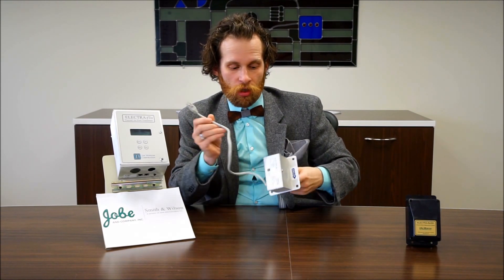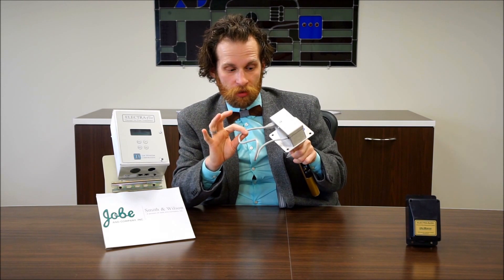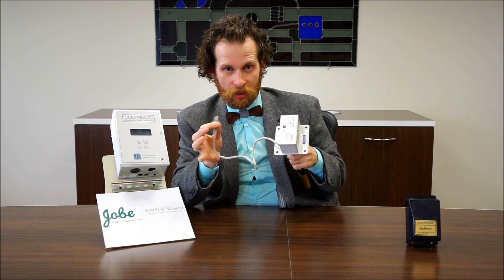Additionally, they've got the Electroflow probe. The Electroflow probes are fantastic — they don't have integral transmitters, but they allow you to daisy chain up to 16 of them together. It's as simple as taking the connector and connecting one to another. Anyone who's been out in the field wiring things up will appreciate being able to just easily connect the wire, and then take one home run back to the transmitter.